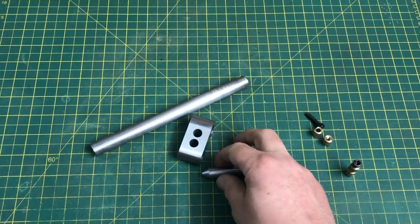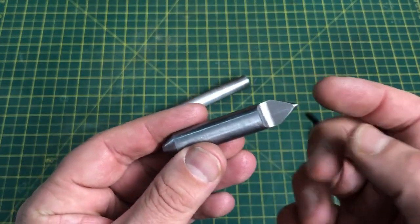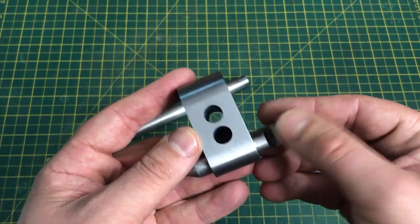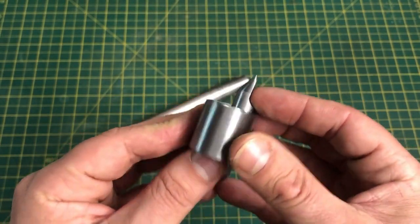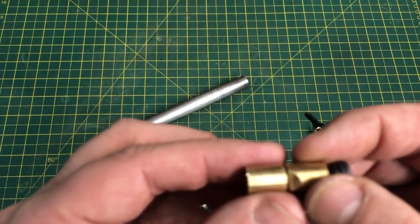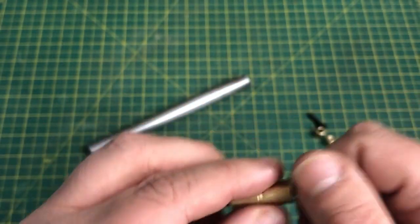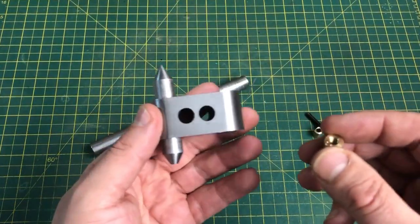Let's have a look at all of these things working together. Here is the tailstock centre, which looks quite nice. I haven't hardened this, but silver steel is fairly easy to harden, so I may well do that at a later date. It fits nicely into the tailstock block, which again looks OK. I haven't gone mad with the finishing here — a quick tickle with a file and then some 240 grit wet and dry is good enough for me. The cotters are split and finished. You can see that the tightening screw pulls the scallops together, which will then clamp the component. I have also marked these with a couple of witness marks, with some corresponding marks on the block itself, so they can always be returned to their correct location.